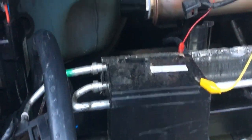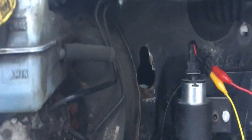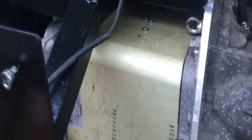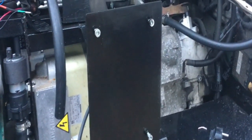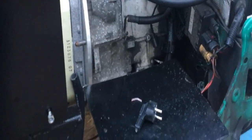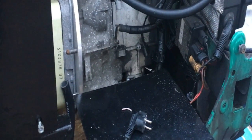I've got a bit of a hole in the bulkhead there because I've got no clutch hydraulics or clutch pedal anymore — they've been able to disappear, which will freak people out if they try to drive it. There's the motor. We have a plate that's going to be for the DC-to-DC converter — a bit vulnerable up front. The chargers are both going to go there; two are going to stack on there at the moment, and hopefully we'll be able to afford a third at some point, giving me 10kW charging.